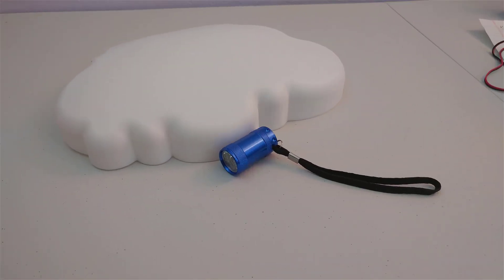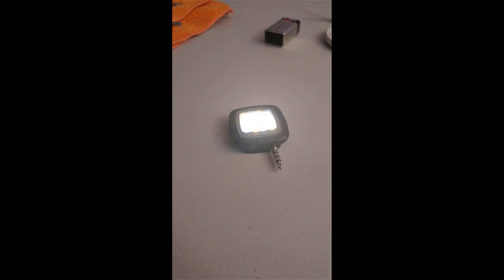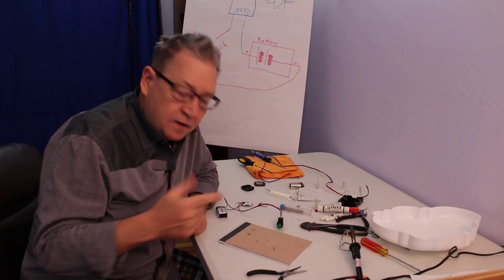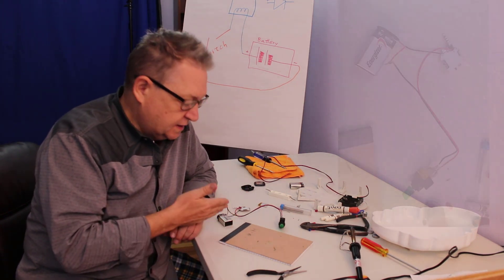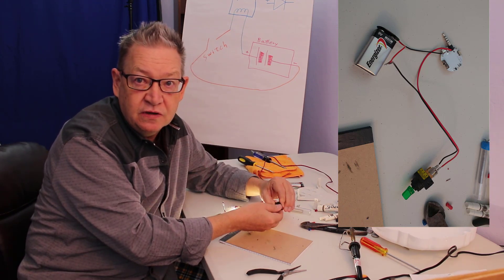When you look through toys in the junk aisle, you'll find tons of stuff that takes tiny batteries, or three AA's, or two AA's. I looked at my original LED idea, then looked at other options like a flashlight - but it wasn't designed to be taken apart. Then I looked at a flash system intended for use with a cell phone camera, and that looked pretty good: nice and bright, and I knew it was going to be low voltage. Here is the somewhat ugly but soldered-together components: simply the battery, the switch, and the light pack. We turn on the switch and the light comes on.